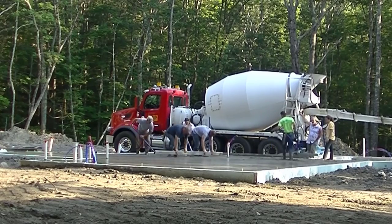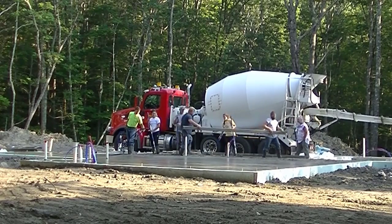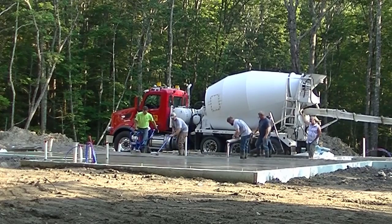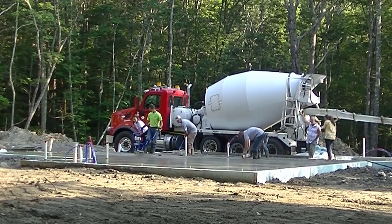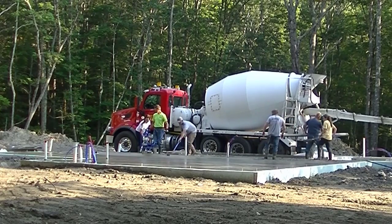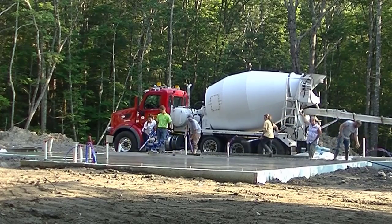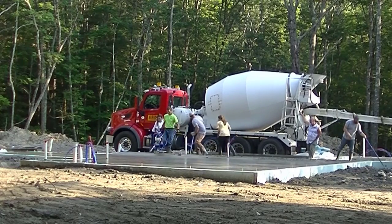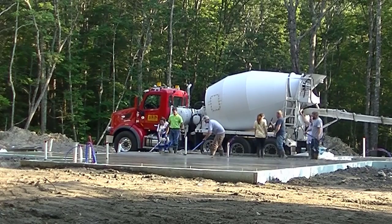We've got some more concrete poured out. Luke and Darren are striking the pad by hand, and then I'm walking around with the Shockwave vibra screed — that thing's got a 12-foot blade on it. So that thing weighs about 35 to 40 pounds — not too bad to move around. It's pretty easy; it's got a really nice handle on top so it makes it easy just to pick up and carry around. You can see one pull and that thing starts right up — it's got a Honda motor on it, so one pull and you're off and running.